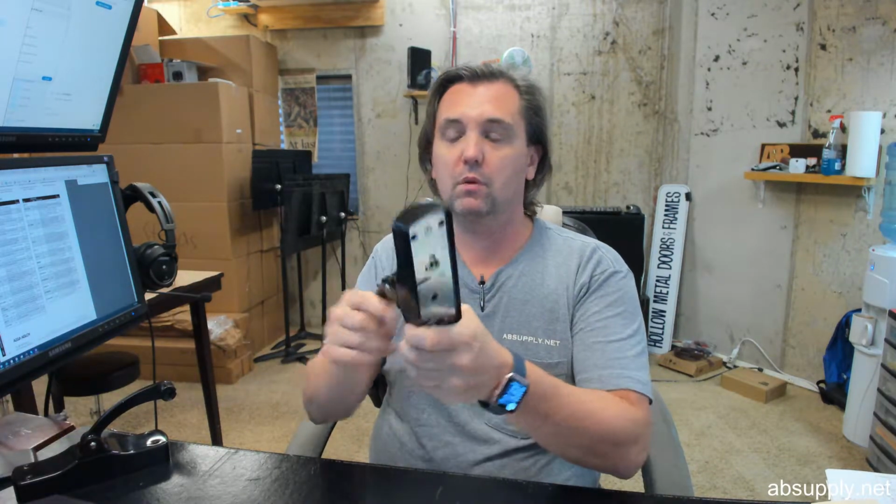However, this is, I'm sure, a grade 1 device, meaning it is rated for heavy-duty use. Oh, forgive me, it's grade 2. That means that it's rated for 500,000 cycles. So that's a substantial amount of use. And if this ED301 is like any other exit device I've ever used from Transatlantic, it will seriously perform to anyone's standards of quality, especially for dollars spent. There's no doubt about that.